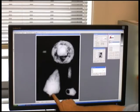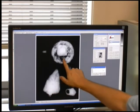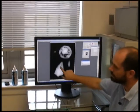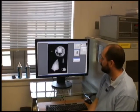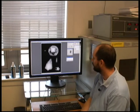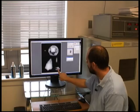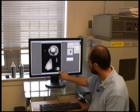With this x-ray, the areas that are in white are more dense and the areas that are black are less dense. This tells me that none of these artifacts have enough iron left in them to be completely stripped, so these would be air-abraded. I don't see any maker's marks on the mason's trowel.